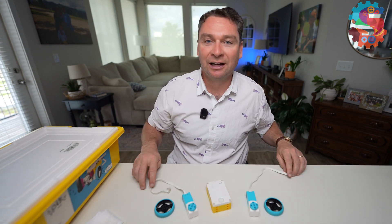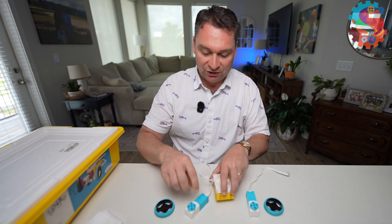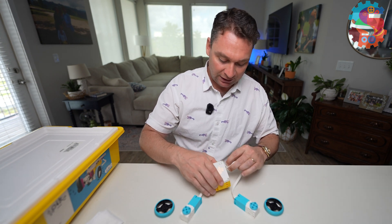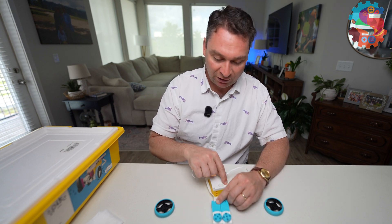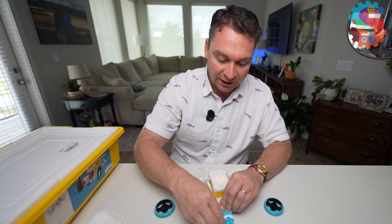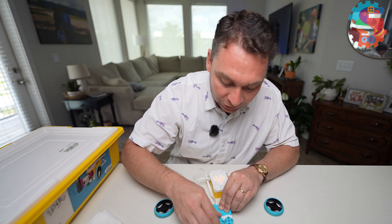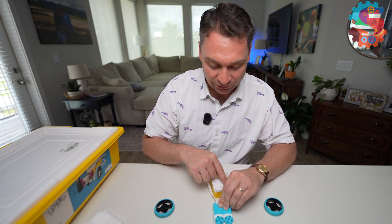The next thing you can do is test your motors and make sure they're spinning at a similar speed. To test this, open up the heart program on your hub, plug in motors directly across from each other, press go on the heart program, then press the arrow — your motors should spin at about the same speed. If you notice they're spinning way off from each other, you might want to replace one of your motors or give it a good cleaning with WD-40 contact cleaner, or electrical contact cleaner. These motors spin at the same speed, so I know they're good.